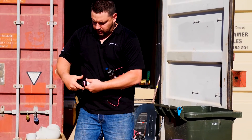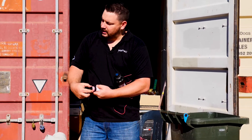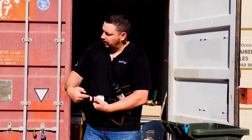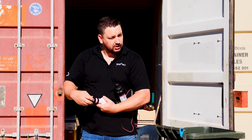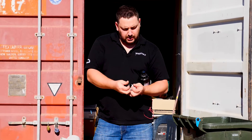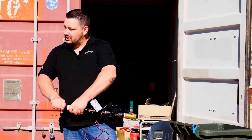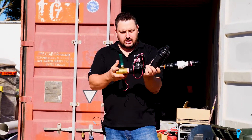The only thing that's different on this installation: you can see that green O-ring. This part doesn't actually need thread tape — you're sealing against that O-ring against the face. You'll need thread tape on all the other parts, just not there. The reason is if you've got thread tape there, it'll open that thread size up, which may flare it and crack it eventually when you've got that seal.